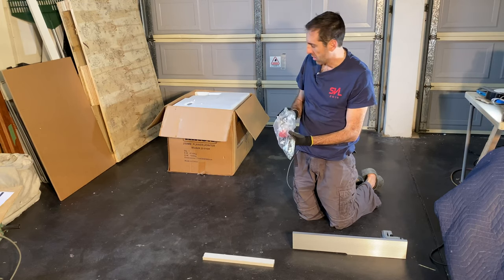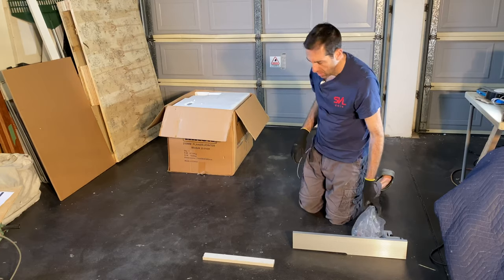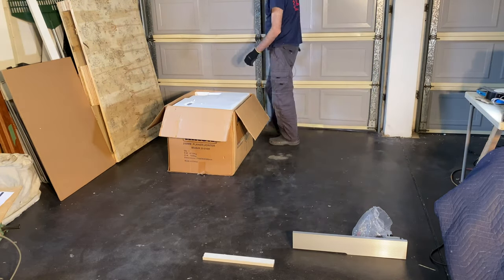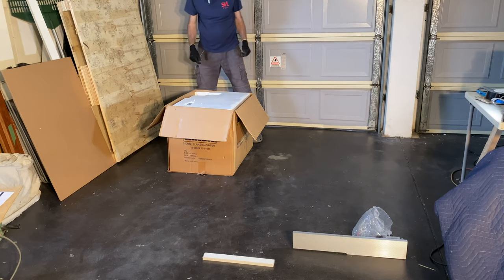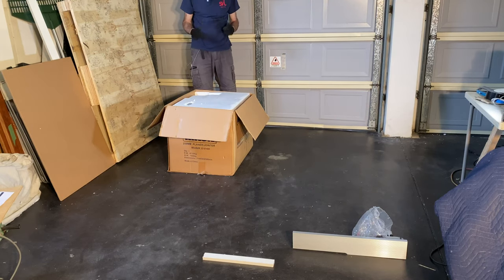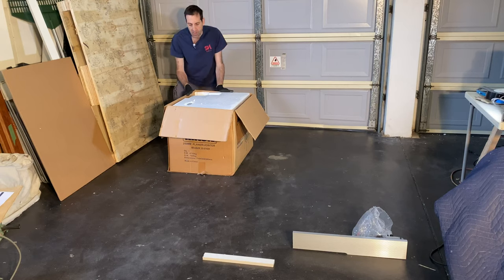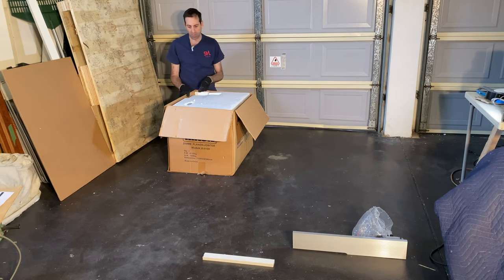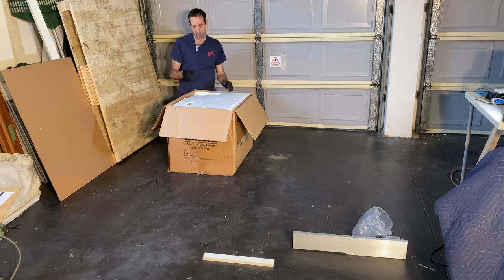So this has a helical head, which is designed to have more of a shearing action when it's cutting, as opposed to a straight, sort of like chiseling action, like you would have with a normal blade. So normal blades are quite long, and there's probably two or three on a cutting head, whereas this has lots of little blades, which should give you a better finish.